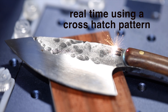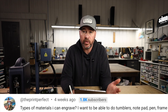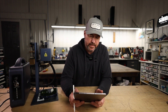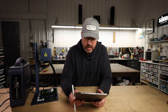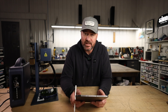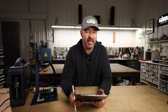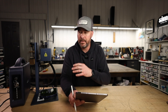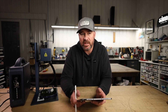You definitely spend more time setting up your etch than the machine requires to actually do it. On materials — tumblers yes, but you'd need a rotary attachment, which I don't have for this model. Notepad: this thing does not mark well on paper at all. Leather: it kind of does. Wood: it kind of does — results vary. These machines are mostly designed to work with metals, precious metals, brass, copper, plastics, and acrylics. Natural fibers it just doesn't do well with.